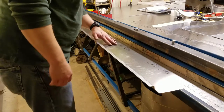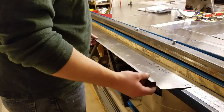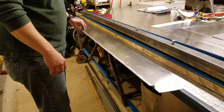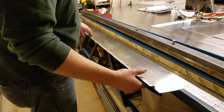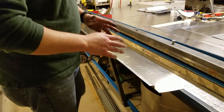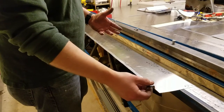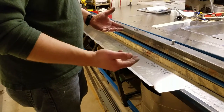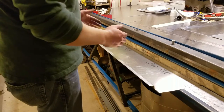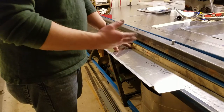I've got the skin slid out here — you can see the little jog the 18 millimeter flanges make. I can tease those angles a little better manually if I need to once the time comes. They look pretty good as it sits. That's what we use the test patterns for — to make sure we can eyeball what our angles need to be, especially in these tighter areas, and then determine if we can make that pattern to begin with using a simple test piece. This part just needs to be bent at 90 degrees, so I'm going to go ahead and bend that.